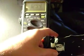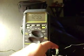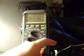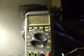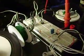As we get this reed switch closer in, just until it activates — the voltage jumps up massively. I've got two capacitors — they're 50-volt caps in series, so it can handle above 50 volts. There's a little bit of drag on the wheel. Just the two AAA batteries, 3 volts, running this coil — it's not real efficient but it runs the motor. I thought that was pretty cool: we take the one-and-a-half volts this generates into these caps, and then at a certain time, with the switch, short out the coil on the caps and release — and you get 55 volts.